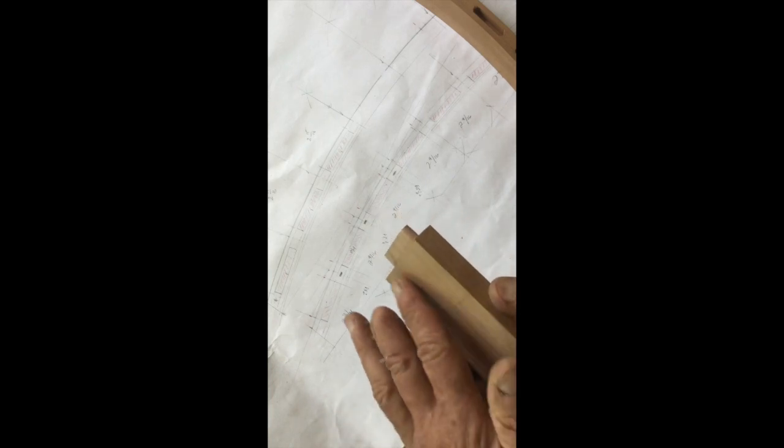And the nice thing about this too is these staves being about 5/8 of an inch thick, they're thinner now because I've shaped that edge. You're not going to know if I have to take a little bit extra off the back side on one edge, one side of one stave, or take a little bit more off the top of another stave, just so they all fit together. That's the most important thing. And if it's a 32nd of an inch thinner somewhere along the line, who cares?